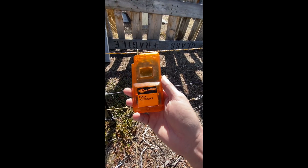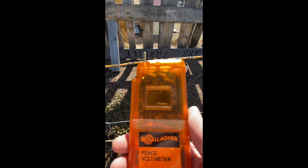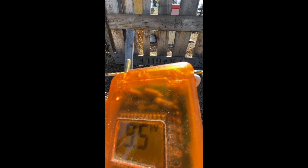So if I test this — this is 10kV to the ground, which is actually decent. Hard to see but basically close to 10 to the ground. And if I touch one of my ground wires — it's 10, 11 — so this is where you can actually test the quality of your ground. And there it's 12kV, which is perfect — that's the max output of this charger and that's what you want.